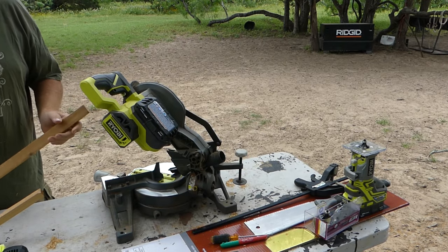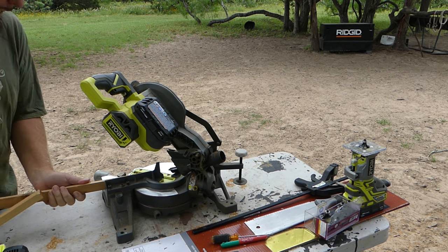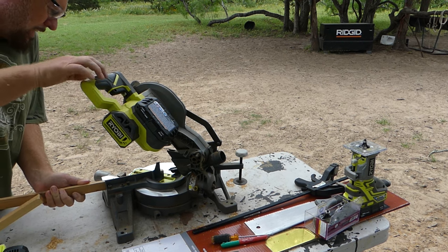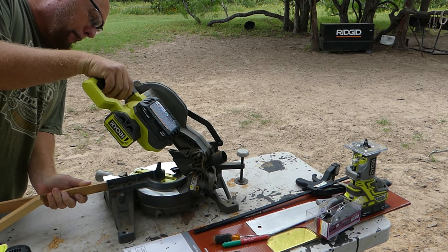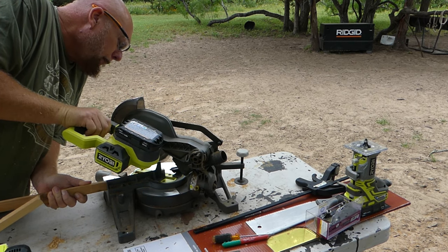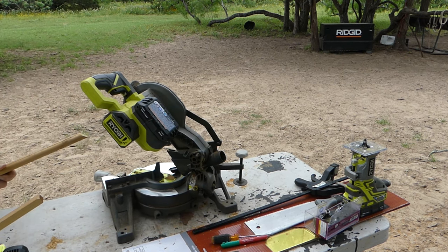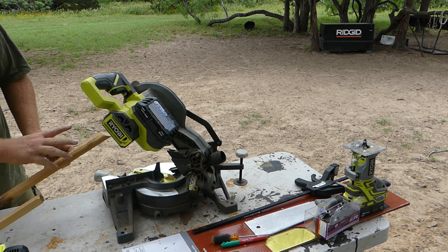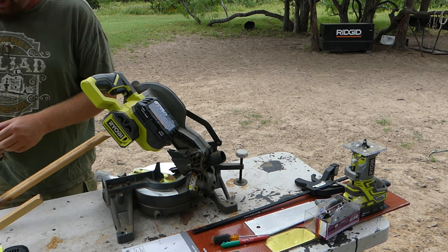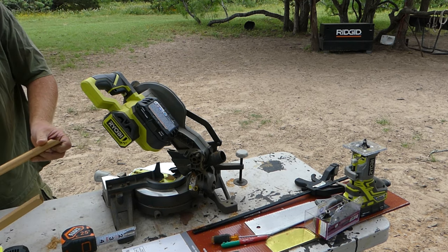Now I like these. They've been reduced a little bit without becoming quarter rounds or something predictable. Let me see if I can get some 45s chopped in there. So I'm going to make a measurement, and each one of these I'm going to cut in place, cold fit them or dry fit them, and away we'll go. Tops and bottoms both say 20 inch. We'll do it. So that surprises me.